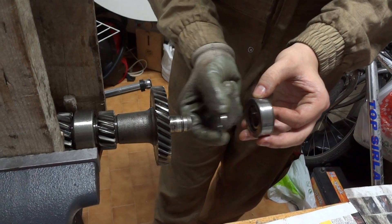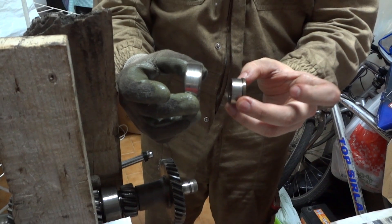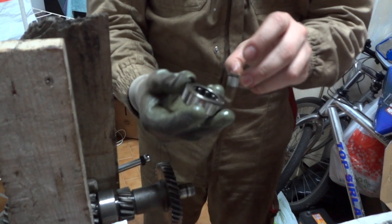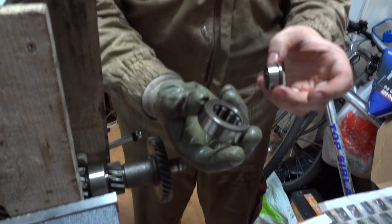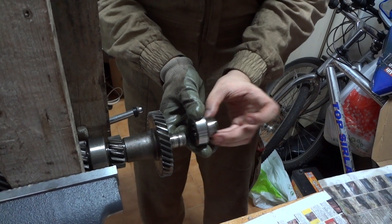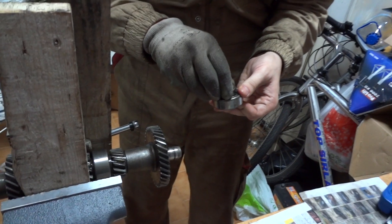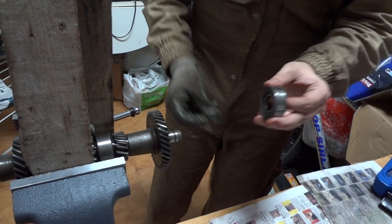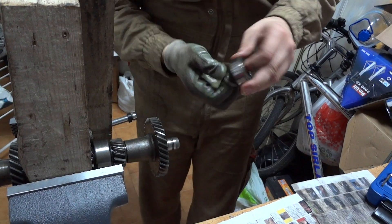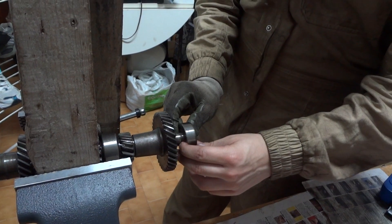The spacer ring is turned towards the gear. The race inside the bearing is on the outside, and the letters are also turned to the outside. So the assembly order is: the race, then the bearing — the race goes in the middle — then the bearing, then the ring. This will be inserted under pressure to reassemble.